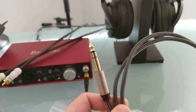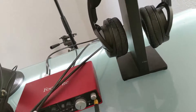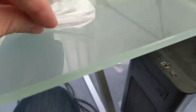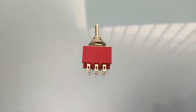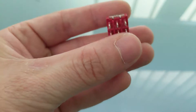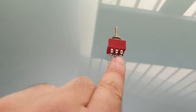For the connection from the PC to the switch box I'm going to use this cable here, which is a 3.5mm to normal stereo jack, just because I had one lying around. For this I'm also going to need a stereo jack input. And the most important part is the switch — what you need for this is a 3PDT switch, a 3-pole double-throw switch. This looks something like this. It has 3 poles, which basically means these are three switches in one, and every time I change the switch it switches all three poles at the same time.